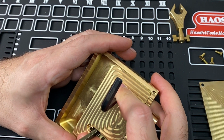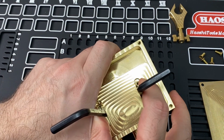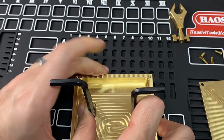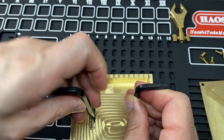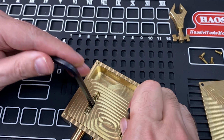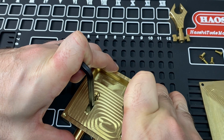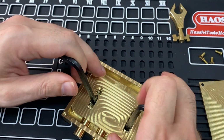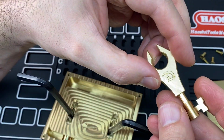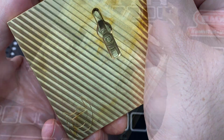the wafers like this. Now what I've got to do is align that with the center there, so I can push the bolt back as I manipulate the wafers with these two hex keys, which sounds a bit crazy, and well, it sort of is. It's not easy, and there we go. But we have moved it forwards a position. Can you see? I couldn't do that with a key because it would go too far this way, I think. So now I've moved it one position.